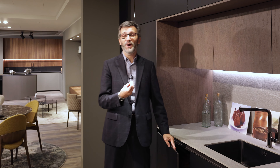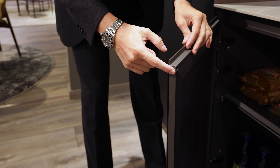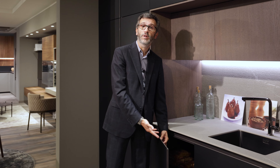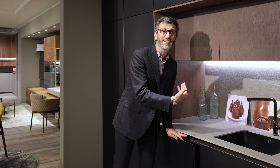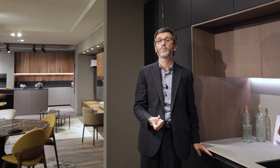What is so special about this type of door is that we have this aluminium frame which goes all around every door. This aluminium frame is 16 millimeters thick and it has a built-in grip on top of it. This sort of way of building kitchen doors is good in terms of reliability and practical use because it makes the door basically hollow inside — we have an overall thickness of 22 millimeters but it is hollow, it is empty. So it's actually lighter in weight in comparison to a full door which is maybe 20 or 22 millimeters thick.